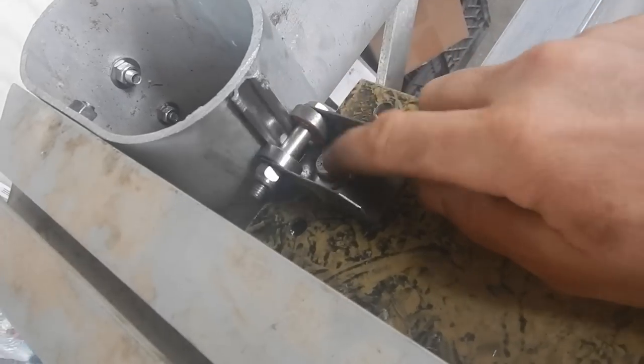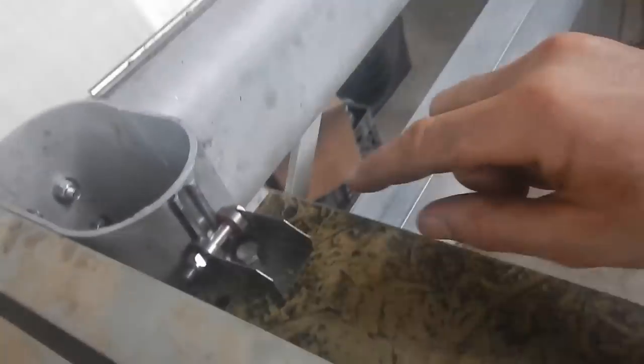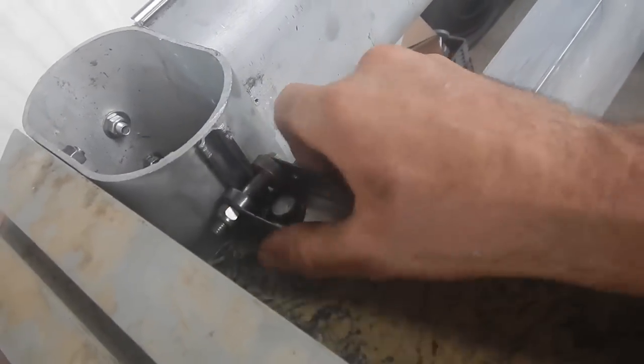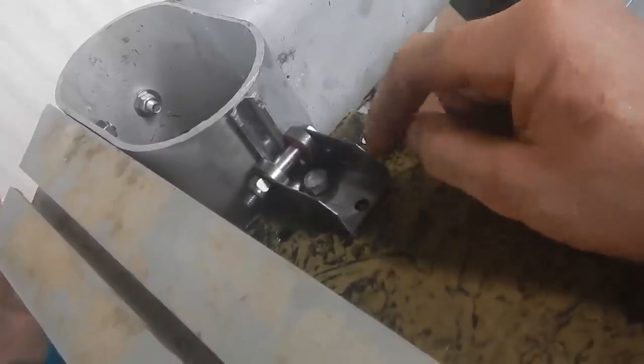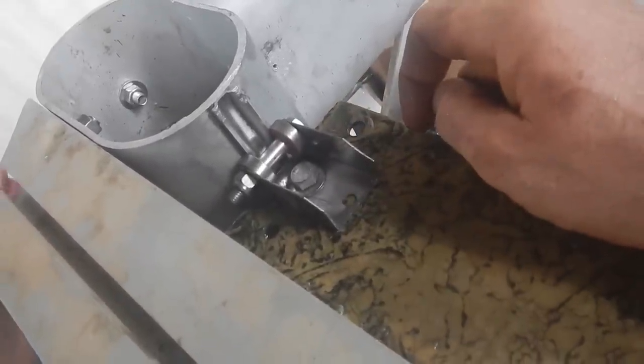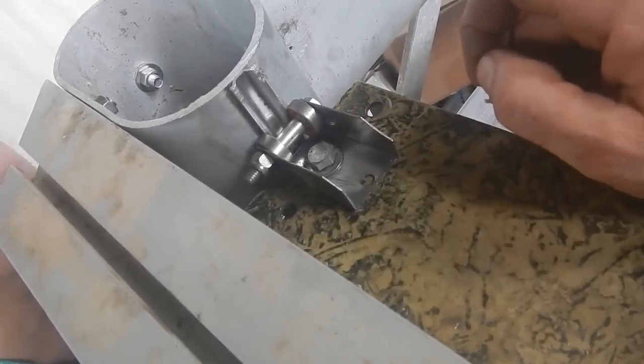Beauty. There's a good chance this will be fine with just one screw, but if I take my clamps off and test this and, you know, these twist, it's gonna be a pain to get them lined up again. So I think I'll just put the second screw in right now, even though I probably, I don't know. I'll just put it in to make sure.